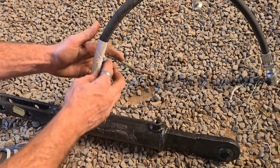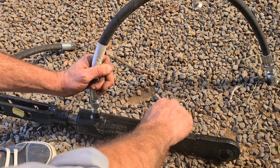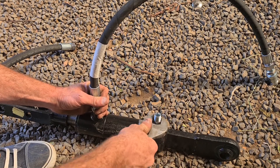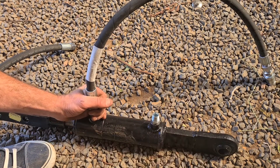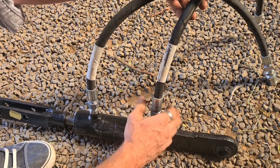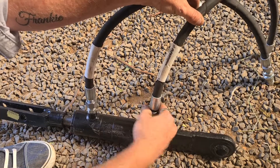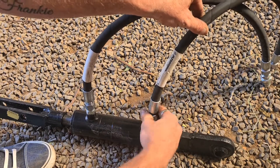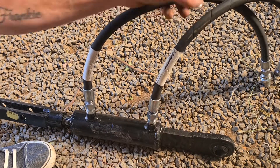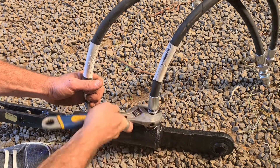I've got this reducer nut here - screw that on there nice and tight, because we're dealing with some pretty insane pressures when it comes to hydraulic lines. Nice and tight is always the key. Then we'll go ahead and screw this guy on. It should glide on fairly easily, and if there's resistance, there's a good chance you're cross-threading it. Undo it and adjust it to get it to go on reasonably smooth - you don't want to cross-thread these, it's an unnecessary hassle that can easily be avoided.